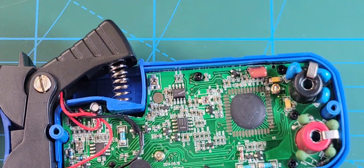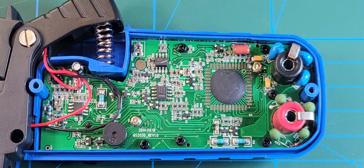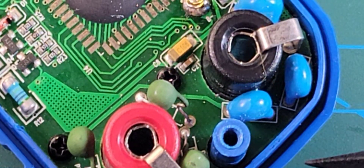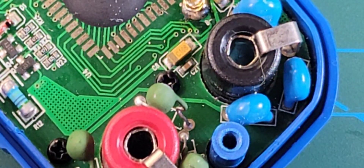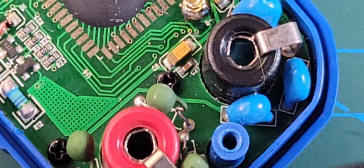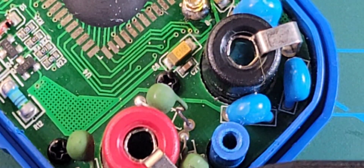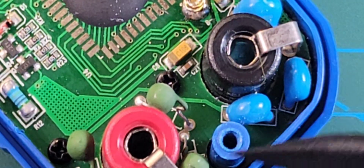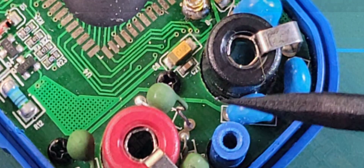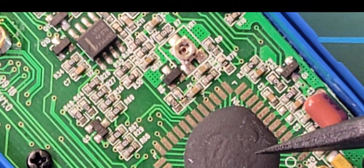Now, the crux of the show. I was a little bit surprised here. Look at those PTCs and MOVs — quite a few. Four PTCs and three MOVs — definitely a bonus. They are surrounding two split-type variety jack inputs. Soldering overall is pretty decent. That's a 48-pin package — which IC is it? Honestly, I do not know.